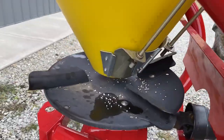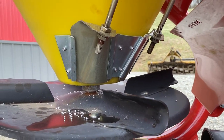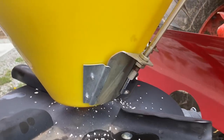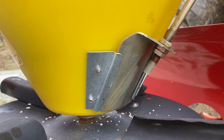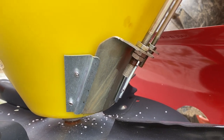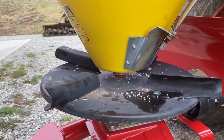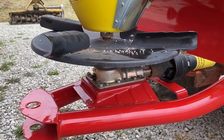It has a standard two-opening-door design to allow the fertilizer to come out. It has two handles — they're locked together now, but they could be separated. I did spend some time adjusting the gates; you can see the adjustment nuts there on the doors. There's nothing in the manual about it, but I didn't like where they were set — they basically stayed closed for half the travel of the arms. I got those adjusted so very little to no material leaks out, and they do open what I think is more correctly.